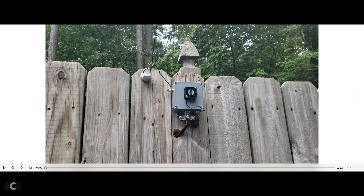So there's the completed transformer. There's my ground wire — I've got a ground rod right down below. There's my RG213 coax and my power wire. There's that ground clamp from Lowe's that clamps right on the PL259 good and tight, so there's no need for a separate ground lug. So there we go — fully tested, high-power end-fed half-wave transformer, 80 through 10 meters. That's all, thank you for watching.